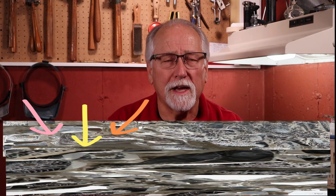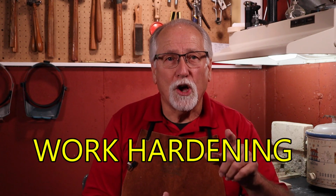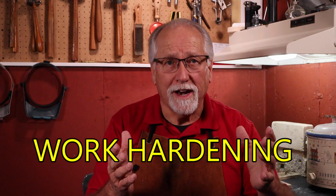These actions and hammer blows start to compact the silver crystals, forcing them closer together. The crystals start to line up into layers, putting less space between the crystals and less intertwining. This makes the silver hard and not malleable. This hammering process is called work hardening.